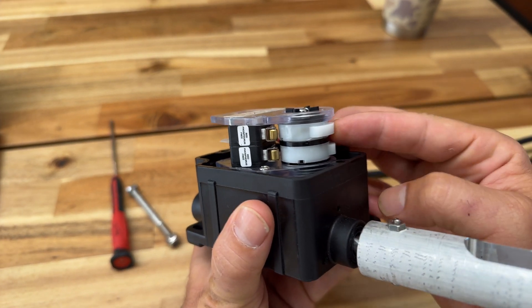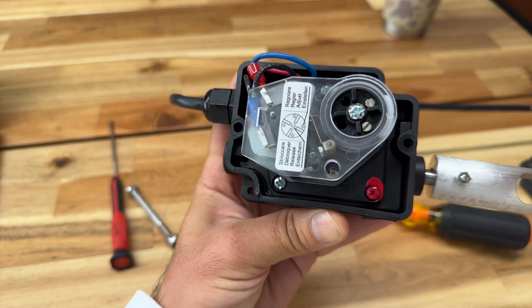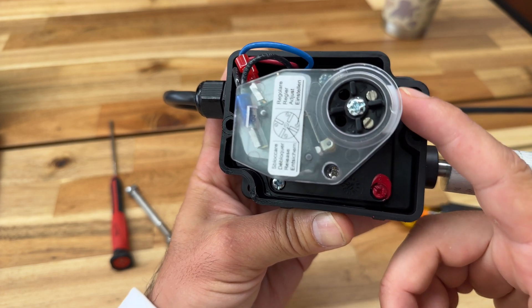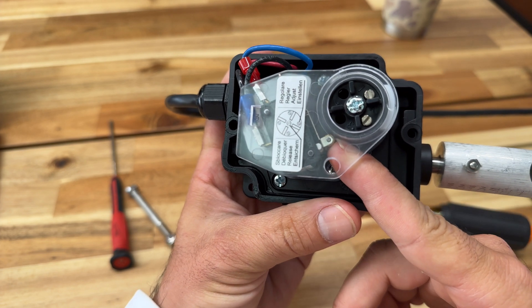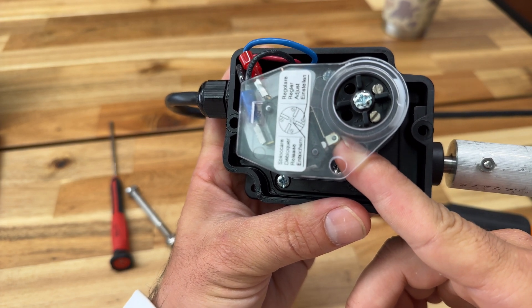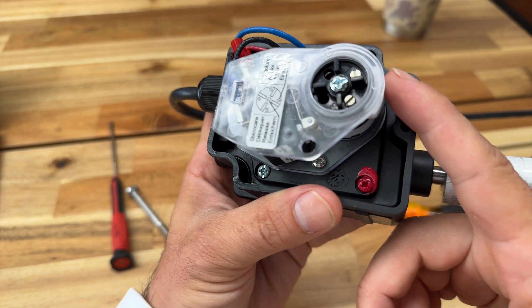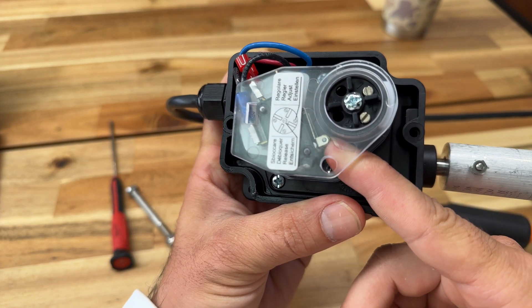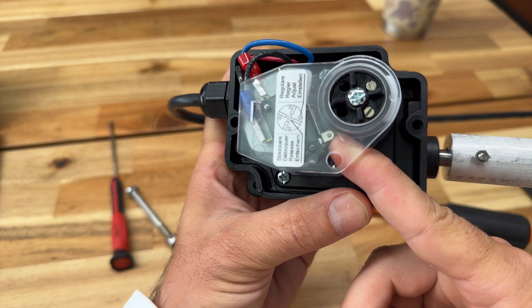When the rollers hit the plastic, they depress a small button — we call them a contactor. Pretend my finger is the rotor plastic: as it spins around, as your lift is going up or down, it pushes until — hear that sound? That is the roller bar hitting the rotary plastic piece to depress the contactor. The contactor is what tells your lift to stop.